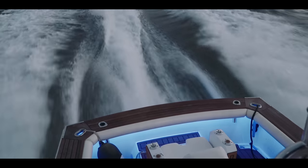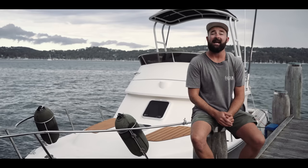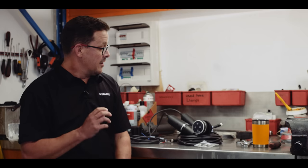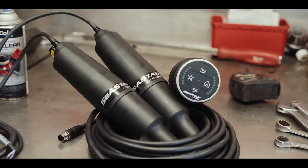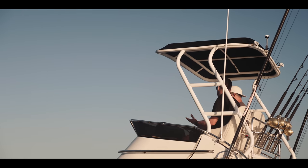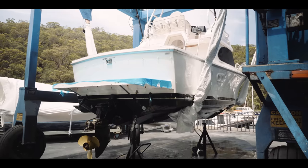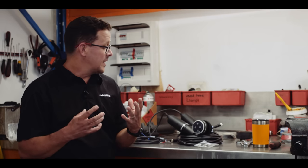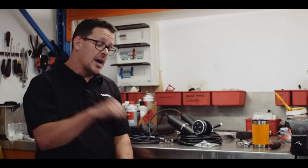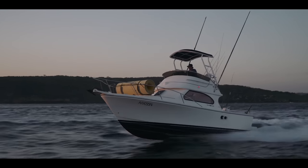Simply put, you cannot drive this boat without consistent inputs to the tabs and the trim on the motor. The latest technology from Dometic promises to solve that — it's called Adaptive Trim Tabs. The same company that brought us Optimus digital steering is now in the stability business. This is actually the first system installed and running here in Australia. With a flybridge and fair bit of weight up top on a small single stern-drive Mercury, getting out of the hole is key. The Adaptive Trim Tab system has a 'hole shot mode' — as you put the throttle down it kicks the tabs down automatically, gets you out of the hole and brings you up onto the plane.